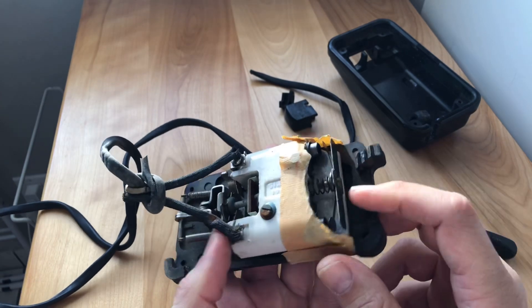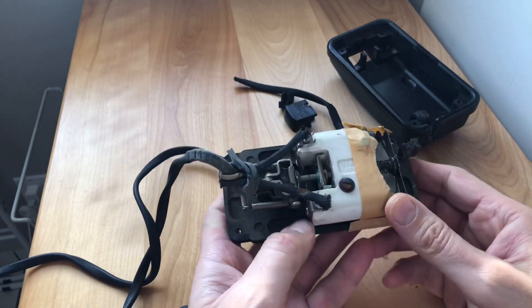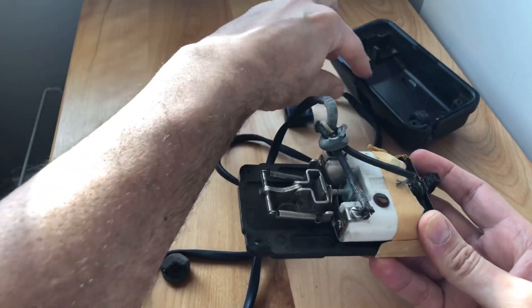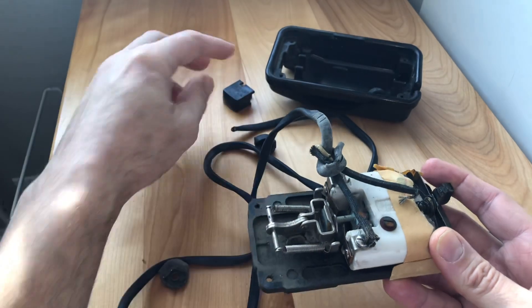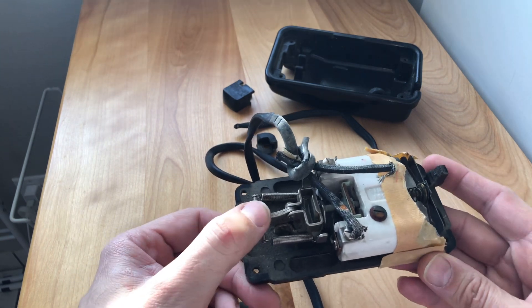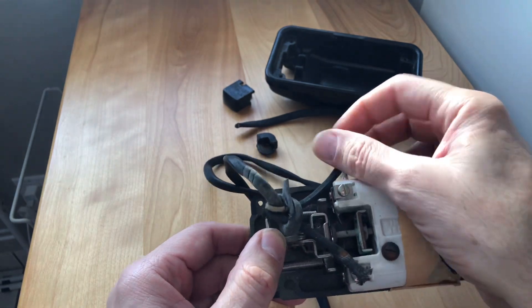This is an interesting opportunity to see underneath what's going on with a carbon pile foot pedal. Notice that it's spring-loaded — there are rubber feet dropping all over the place. When the cover is on, the button pushes down on this linkage right here. It's spring-loaded; you can see the two big healthy springs. As you push down, the spring pulls and this piece gets closer to the metal contacts.